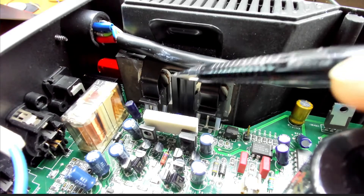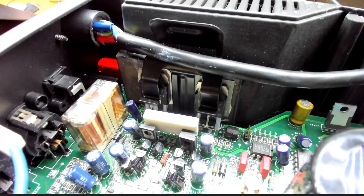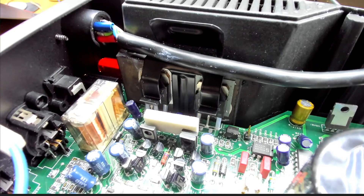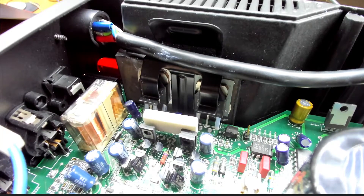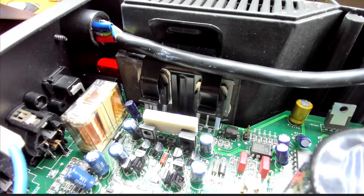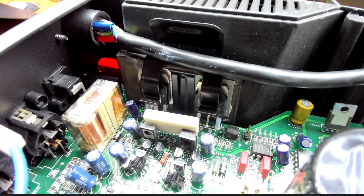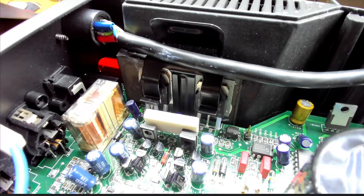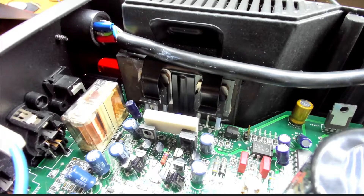The collector of the transistor is sitting at one of the supply rails - whether positive or negative - and so that's just shorted off to the chassis. I suspect the amp detects that and just won't power up. I don't think that's our main problem though - there are multiple problems in here. There are also various missing screws and other issues. So the first thing I'm going to do is configure it to operate without the PSXR, then check some of the supplies.